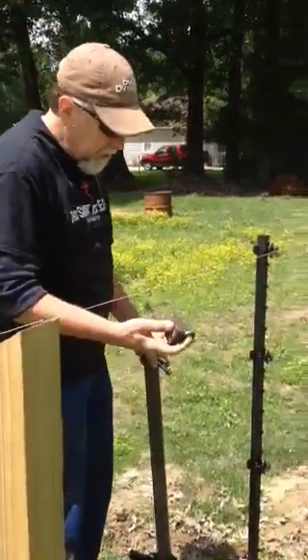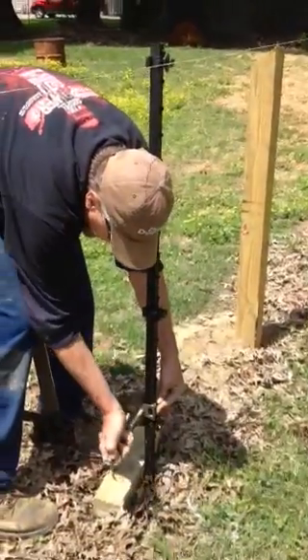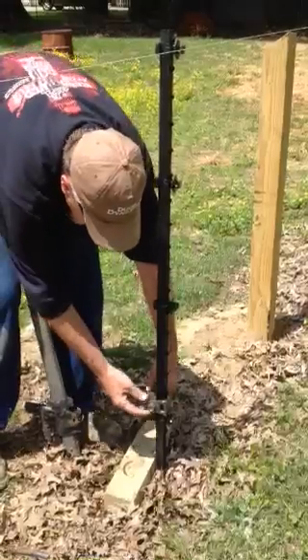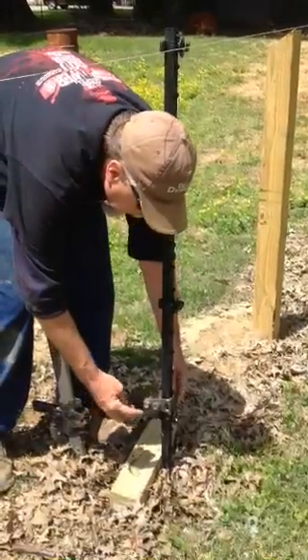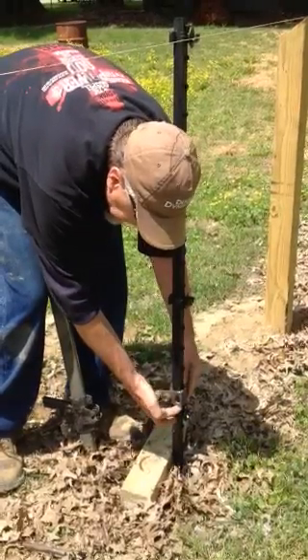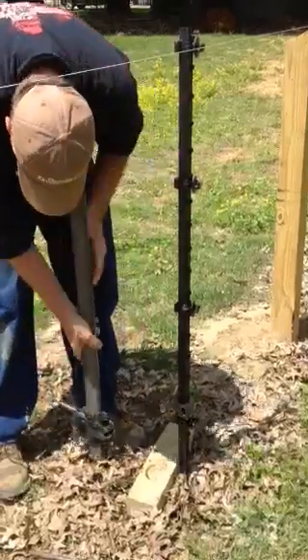This little bracket just fits onto the post. I'll go ahead and put it on — you can see how it fits. I'm using some 12mm bolts to go through it. Nothing fancy, but the critical thing is to have the distance between the back of this bolt and the back of this plate as one and a quarter inches. The width is whatever matches the pole you're pulling out.